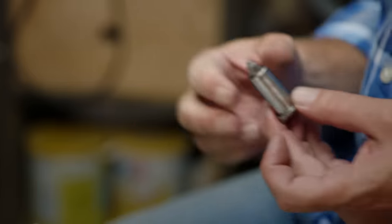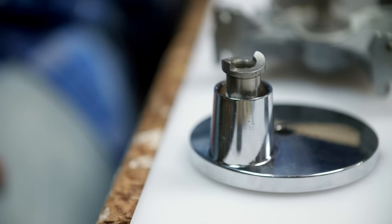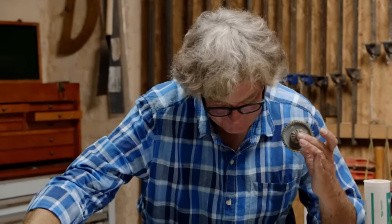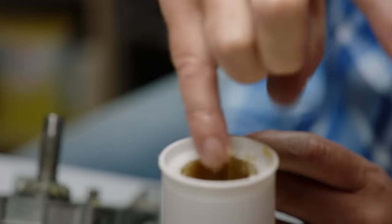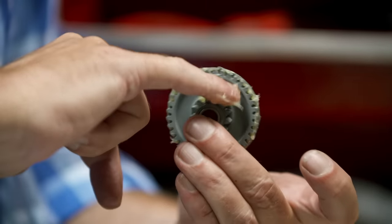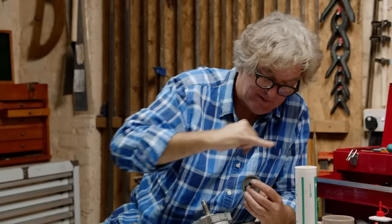That runs in a nice bush — I'm still going to put a slight smear of grease on it. We'll make this the greasing finger. I'm wondering if this is as interesting to watch on television as it is for me to do, because when you sit down at the bench with that pile of bits, you think, oh God, how am I going to work this out? But then once you start doing it, it's a bit like a chess problem — you know there must be an answer and you just have to work it out. Now, I know you all want me to say something about how I love using lubricant. I'm not going to. Having said that, lubrication is incredibly important — if things aren't to wear out, overheat, be destroyed by friction.